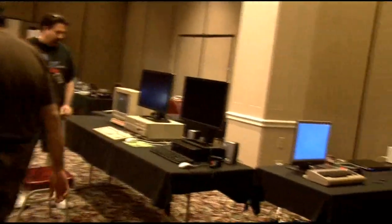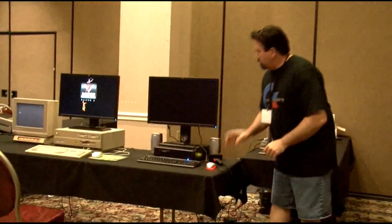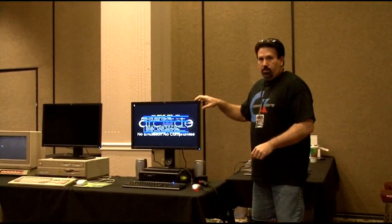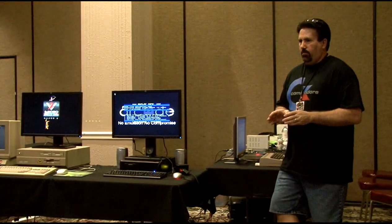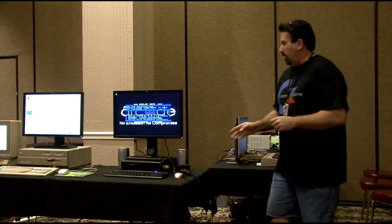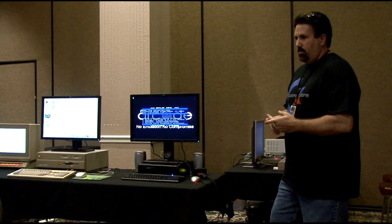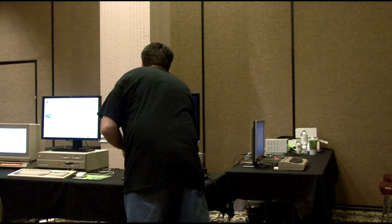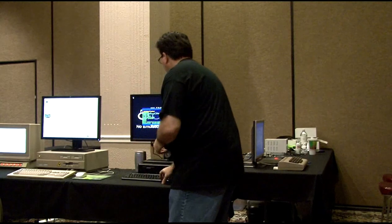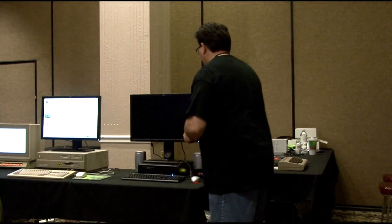So that's my 64 stuff. Around over here in the corner we've got Amiga stuff. I showed this last year — this is the FPGA Arcade Replay. It's an FPGA board with a 24-bit audio DAC and a DVI connection, as well as a composite video output. It lets you use FPGA cores for basically everything that's supported, like real arcade games. It's not emulation of the game — it's the actual circuitry of the game put in FPGA, so you'll see things like Pac-Man. It loads off an SD card, so all you have to do is select what you want.